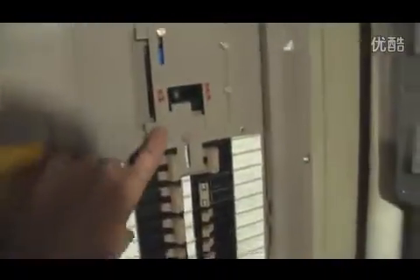This panel is a generator transfer switch panel. There is an outlet on the outside of the house — a 30 amp twist lock outlet — and I can hook up my 8,000 watt generator to it. I flip the main off and flick this breaker on, and now my generator is powering my whole panel along with the sub panel. When I want to switch to battery power, this is my main disconnect for that. This is an interlocking panel cover, so when one breaker goes on the other one gets switched off — you can only have one source of power at a time. I have a hot and neutral hooked up to the breaker, breaking both off the disconnect, so the neutral from the inverter isn't tied to the house neutral at all. The sub panel is separately grounded, and these are the circuits I run off the generated power I create — right now just wind, which will be solar in the not so distant future as well, with multiple turbines.